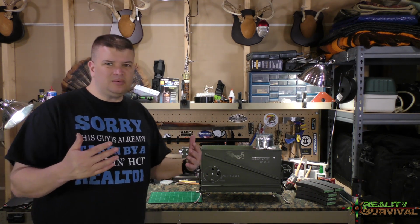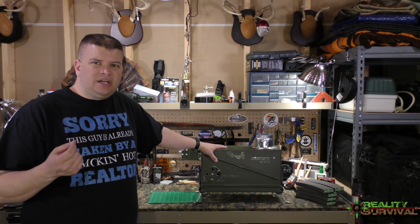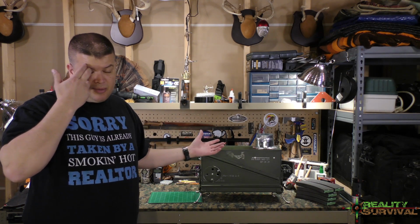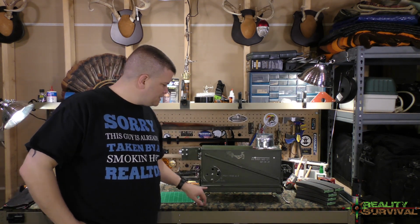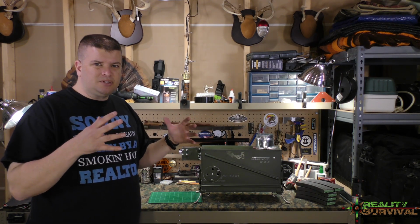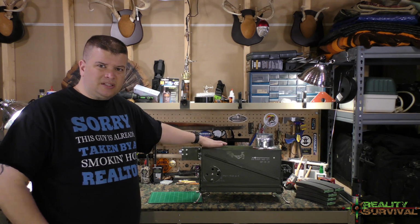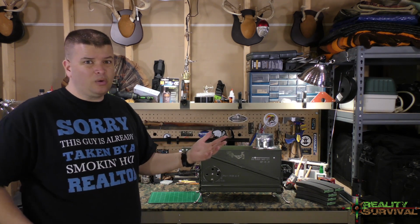My design idea was basically to leave the ammo box as intact as possible, because when you burn these things you get a lot of expansion and warping, since they're just not made to be a stove or an oven. So I tried to leave in all the braces, all the double layer sections and the lid, to help keep its rigidity. The box is actually flipped upside down, and the cooking surface is up here on top, because that is a single layer and it'll hopefully transfer the heat most efficiently. That's at least my goal anyway.